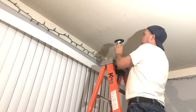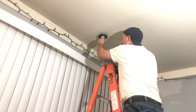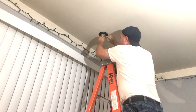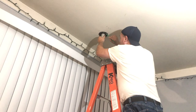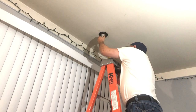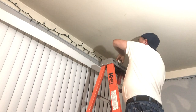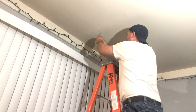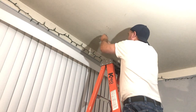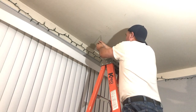The next step — using a ladder and safety equipment, as well as a person to spot you below — find the location where you'd like to install the ceiling mount for optimal viewing. Mark each hole required for the projector mount to be mounted to the ceiling, and punch holes through the drywall in the ceiling.